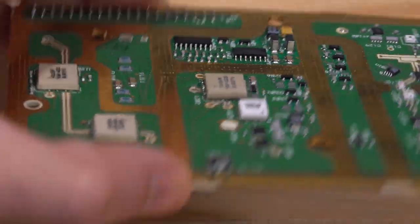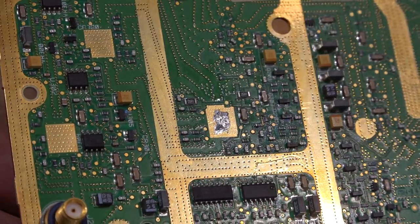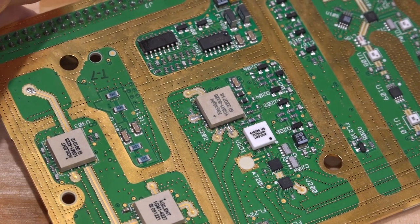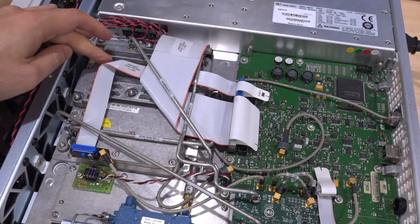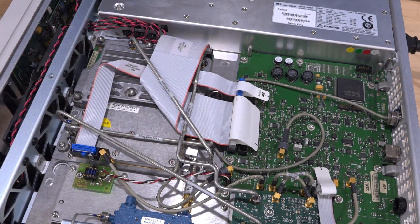Now I'm going to actually assemble it completely. Put the thermal pads over here — you can see this is how the other side was heated. Before I test it, there's going to be a little bit more work, but I don't want to run this without the necessary thermal management in place. New thermal pads — it's all put back together. I think the thermal pads are making good contact and the coax is also reassembled.